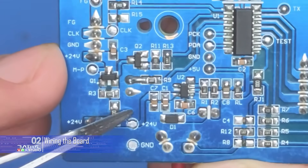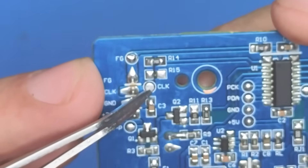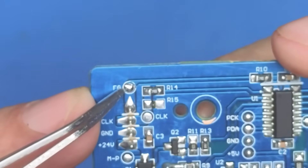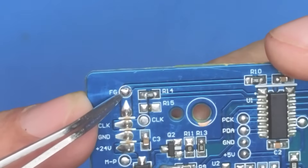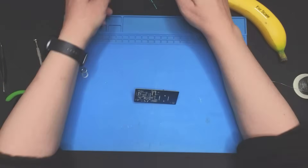On the bottom of the board we've got some nice solder points. We've got 24 volts in and ground coming in off that connector, and also a clock signal used as a kind of PWM for the fan - so we're going to pulse that on there. Coming back from the fan we've got a pulse signal so we can tell the speed. In this case I'm going to use that to track filter age - you'll see how that works in a minute.